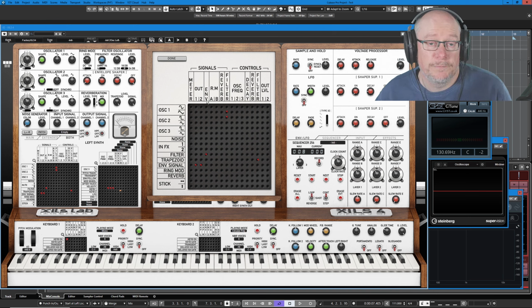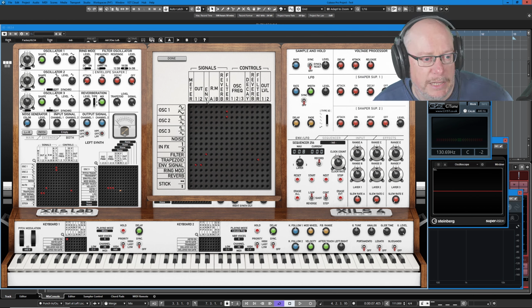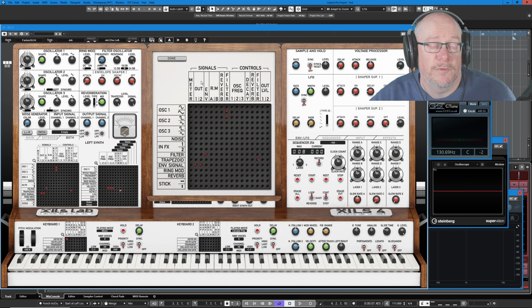So in the analog world, that tiny little control voltage signal would be amplified with the voltage controlled amplifier, the VCA, and now this big hefty signal is ready to pass to the outside world. It's ready to push the cones on your speaker, drive those big magnets, end up as sound in our ears. So the envelope was a destination when it received the information from the filter, but now it's a source. Here the envelope is outputting its information to the left and right channels of our output bus, and we're going to hear it. So that's the full signal path from oscillator to filter to envelope to the outside world.